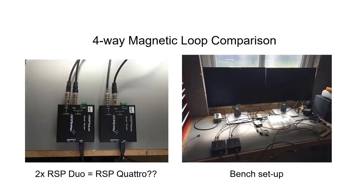The setup used two RSP Duo devices — perhaps this should be called an RSP Quattro — to receive signals from the four antennas. They were connected using RG58 coaxial cable, 20 meters of it between the bias T and antenna. The cables between the bias T and the radio were identical for three cases, except for the Welbrook which had a hardwired connection. Two monitors were used and photographed to allow comparison between all four waterfall curves simultaneously.